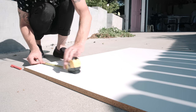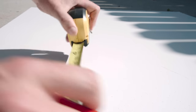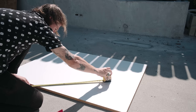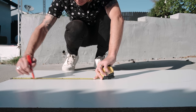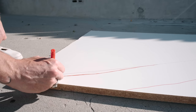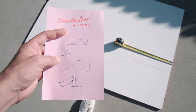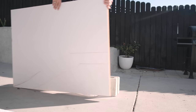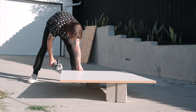I started with a piece of melamine wood I purchased from Lowe's and made a few measurements — one for the height of the kicker and another for the length. I decided two and a half feet as the height and eyeballed the length, adding a little more curvature and transition to the bottom. I also referenced a few concepts I drew up, and marked up measurements for the 2x4s that will box in our concrete.